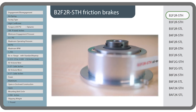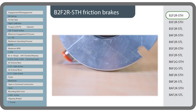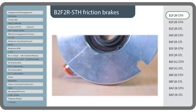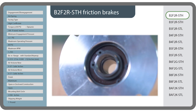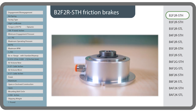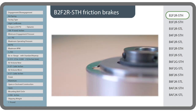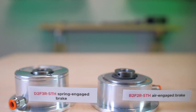Of course, torque capacity is only one factor when selecting a brake. Mach 3 recommends that design engineers contact the engineering department for application review and assistance. The pneumatic supply must include a flexible airline and correct fitting for the brake inlets and PT size and fixing with a thread sealing compound. Air supplies should be both filtered and regulated.